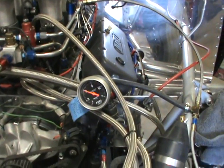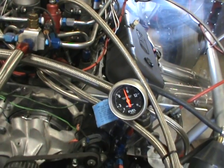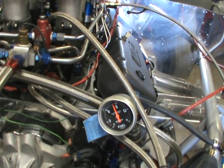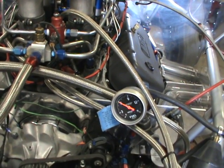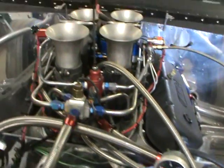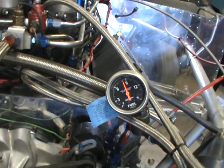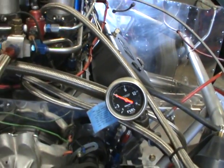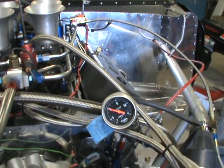So now I'm going to turn the system off. The pump is on but the solenoid is off and it's got just over eight pounds — which is really okay, even if it had 15 pounds it doesn't matter. Even if there's a creep from eight up to 12–15 pounds, it doesn't really matter. As long as when I release this clamp here — simulating the solenoid opening — that pressure goes back to six pounds, and it does, and it stays there steady. That's why I love that regulator: it dropped just below six but recovered right away and stayed stable at six pounds, and that's what you want.